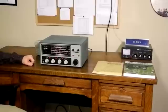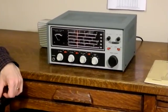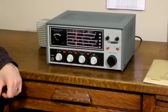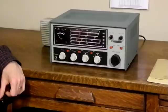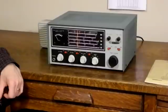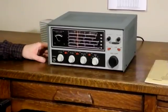The notable features of the radio include coverage of the five classic HF ham bands, use of seven miniature tubes — no transistors or integrated circuits here — a crystal lattice filter with fixed 3 kHz bandwidth, a 1681 kHz IF frequency, switchable VFO for receiving CW Morse code and single sideband signals, an automatic noise limiter, audio and RF gain controls, an S meter, and a connector for a TR switch. This switches the antenna and puts the receiver in standby during transmit. It's in a solid metal chassis and weighs about 20 pounds or 9 kilos.